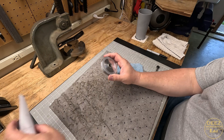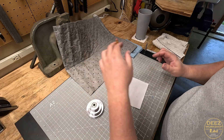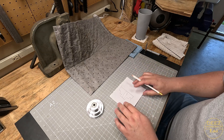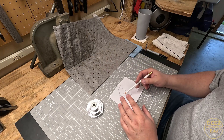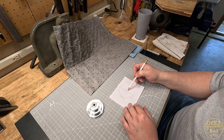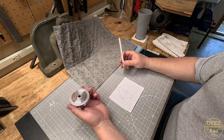So how this setup works — and we'll draw this out too, the final design, and there's a video on this as well that shows it in more depth and detail. Rudimentarily, we have our pulley and there is the bore in here. The original actually had a step in here. You can see this in all my other videos — it had a step, a C-clip in here to hold everything in. There was a bearing here and a bearing here back to back, with nothing back here. The step was actually way back here. You had two bearings sort of in the middle and then a clip, and then the shaft itself had a shoulder that would come in and sit in here. And over time, these two bearings just wore out and this thing would rock. It was a bad design — well, it worked, I shouldn't say terrible design. It just was cheap and easy, probably that's why they did it.